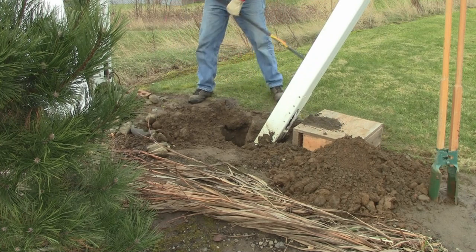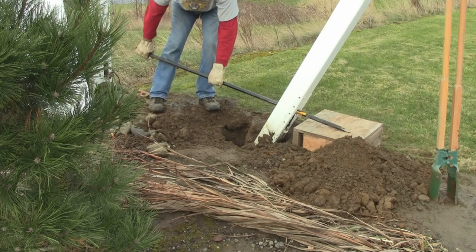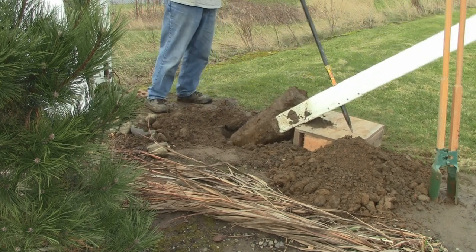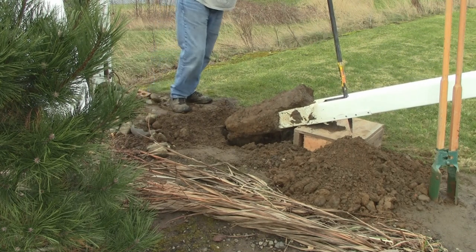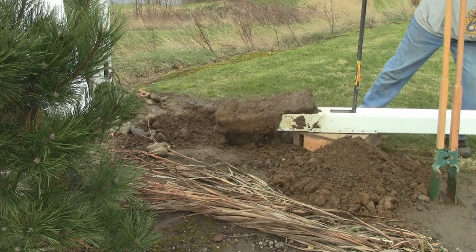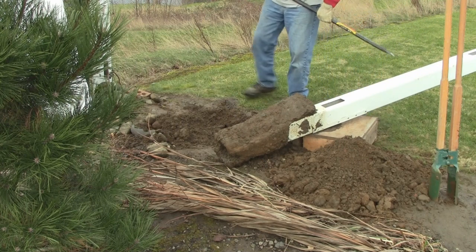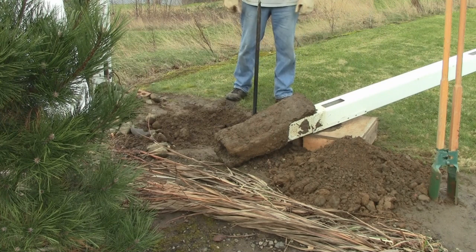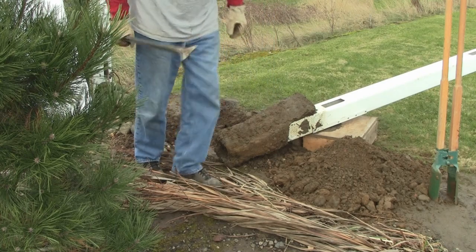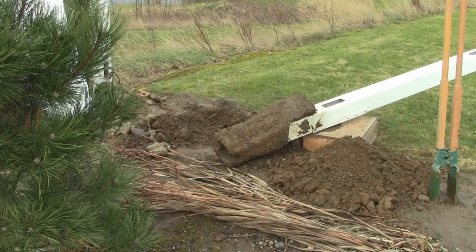Let me show you how to do it right. Put the rod through, get a good grip on the wood, lift it up. See the way the rod is stuck into the wood? Then just turn it — now it won't drop back down inside the hole. Post out of the ground! I spent years trying to figure out how to get 300 pounds of concrete out of the ground without buying five or six hundred dollars worth of special tools. I figured this out with a wooden box and a $25 steel rod from Lowe's — and it works beautifully.